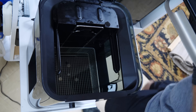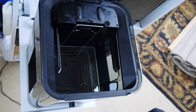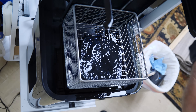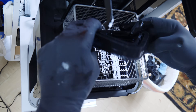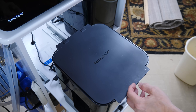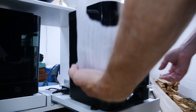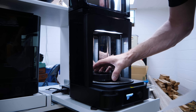This material is really nice, but there are some drawbacks. You do need a special clean-out tank. The liquid is an N-butyl acetate mixed with isopropyl, which is what you normally use, but the N-butyl acetate is needed to help clean the silicone residue. It smells like bananas — quite interesting. It is an additional step and an additional cost. I would say it's not easy to clean these molds; they're a little sticky.